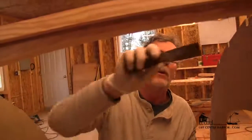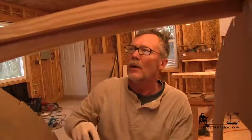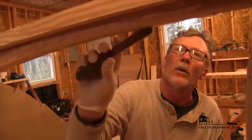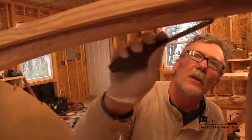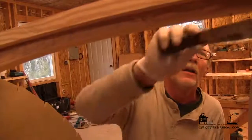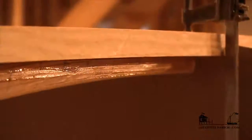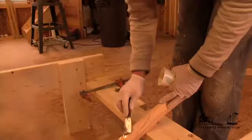So now we're free to reach under there with a putty knife and knife out the excess epoxy for a nice clean up. Because if you learn nothing else before you build one of these boats, you always want to clean up the epoxy while it's wet and soft. Because once it cures, you've got to get out the machinery and the tools and the explosives. There was the perfect amount of glue left behind.